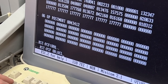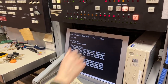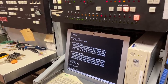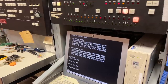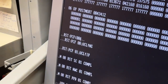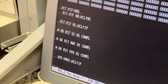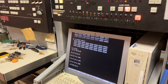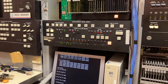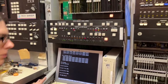Now I'm saying: unconditionally restore your peripheral control frame. That will clear all these lamps. Now I need to update the memory in the offline processor — update offline to main store, unconditional. That will overwrite everything over there with all the information from over here. In the meantime, I'm going to release this alarm and then go clear the minor power alarm, which is on the other side of the machine.